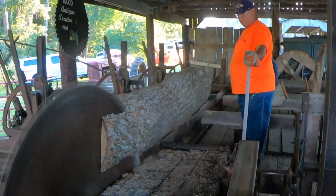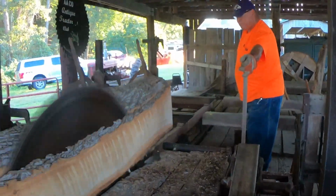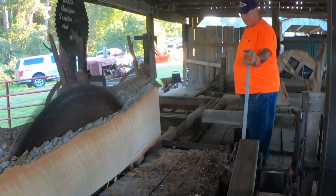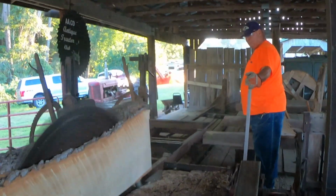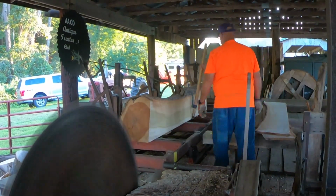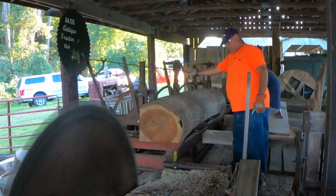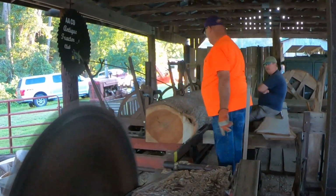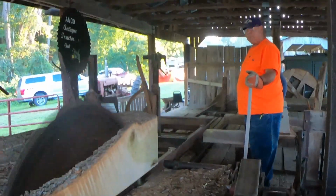So one thing we noticed is this saw has apparently 50% more power than the one we operate on a weekly basis. This thing is unstoppable, and you can really increase the feed rate a lot. So this goes through these logs very, very quickly. Now, the lead at the saw that we operate normally on a weekly basis was wrong, so we're wasting a lot of horsepower. We're fixing that. But this saw is set up nicely, and it's very, very efficient. And try doing this with your little circular saw at home. Good luck.